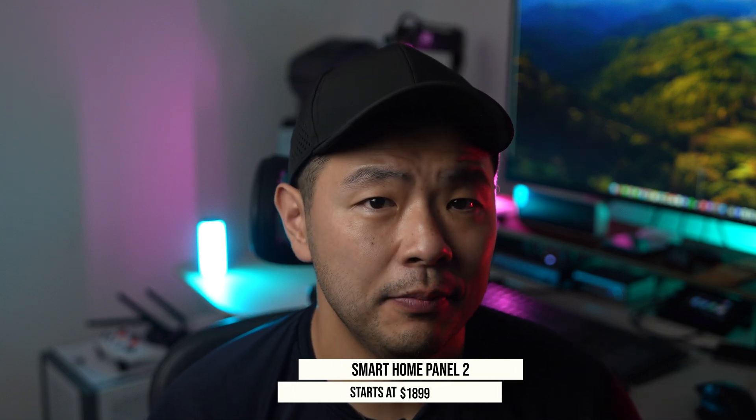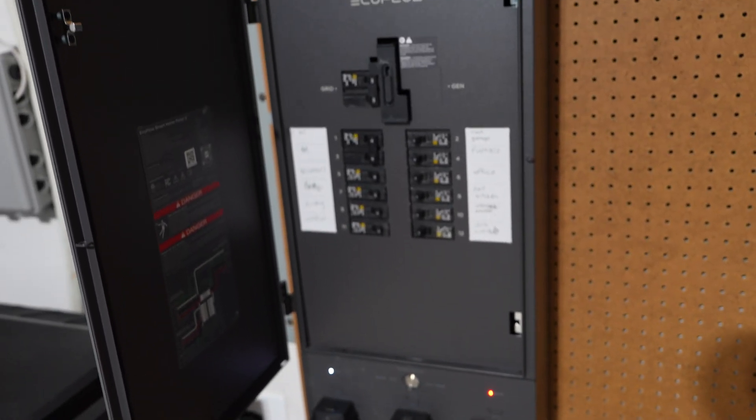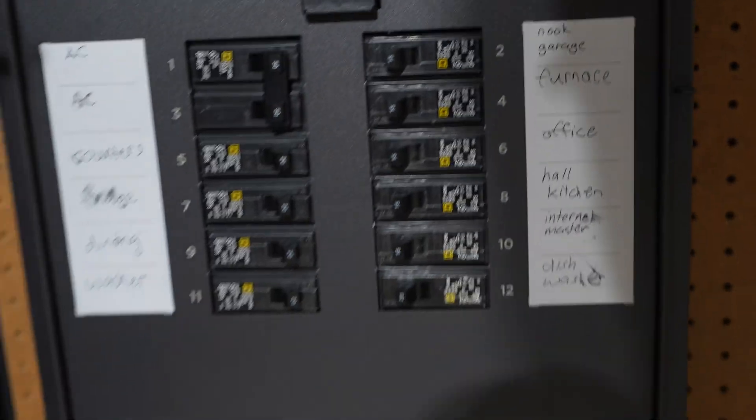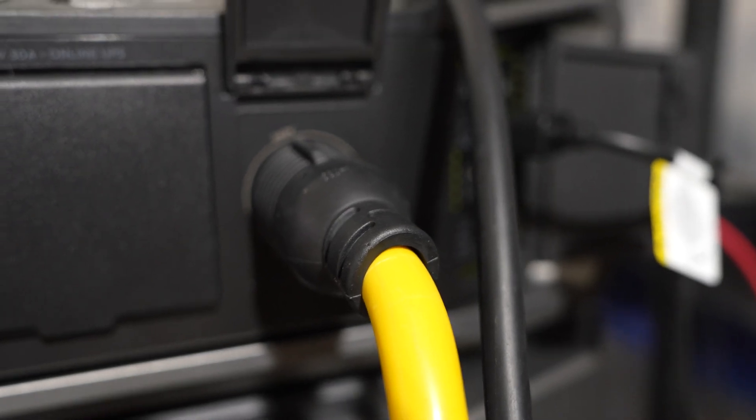A series install for your whole system is probably the easiest route without worrying about parallel connectors or combiner boxes. Now the thing that ties the batteries together and makes the system a whole home backup is the Smart Home Panel 2 — a subpanel with EcoFlow integration and smart features like automatic transfer, time of use, and storm guard. Like the brains of a Tesla Powerwall, it can help you control the power coming in and out of your Delta Pro Ultras to power up to 12 circuits in your home, with more if you use tandem breakers. It can also solidify your DPUs with max charging speeds. The DPU is a very capable all-in-one system: 240 volts, AC and DC power, 5,600 watts of solar input, and a myriad of features.